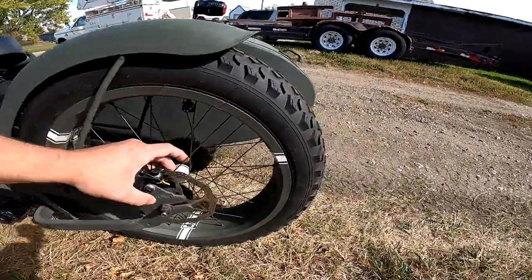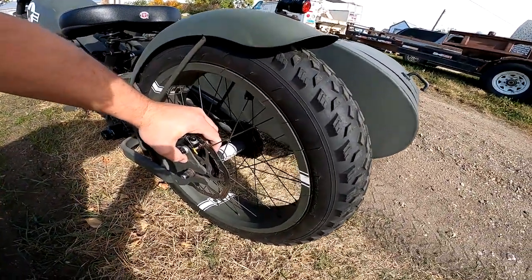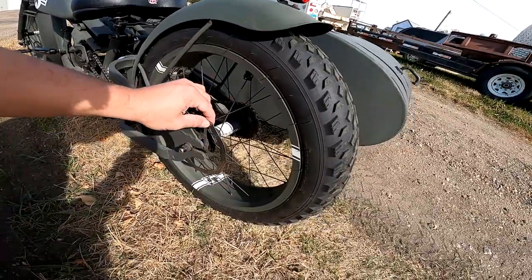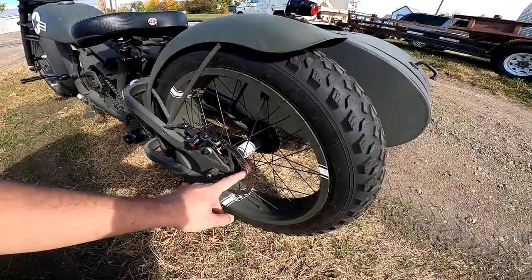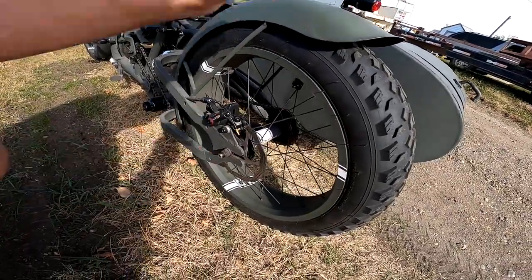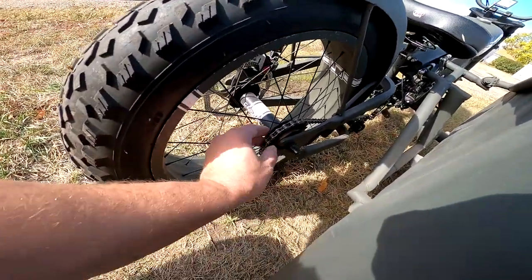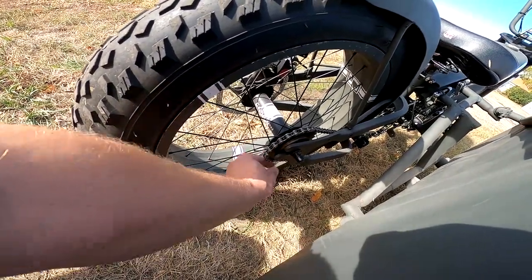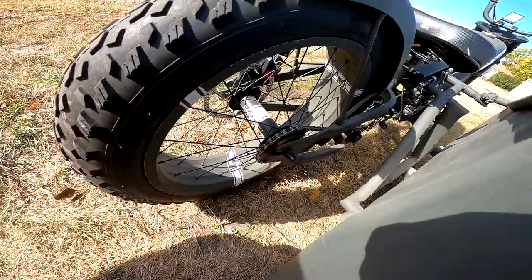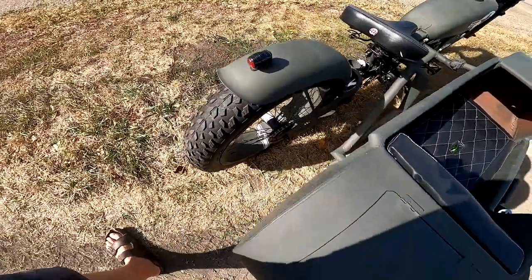And then I refitted this wheel here, I re-centered it, sorry, and then I welded a little ring I made for it to accommodate a disc brake. So now I could put a rear disc on it as well. And then one more modification I did there was to pull off the old freewheel and put a much larger one to gear it down a bit, because it was pretty tough with the original gear on there. I didn't gear it down enough in the center, so I did that, to give me more usable gears.